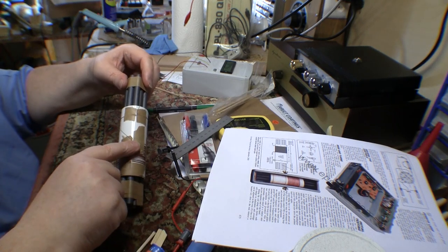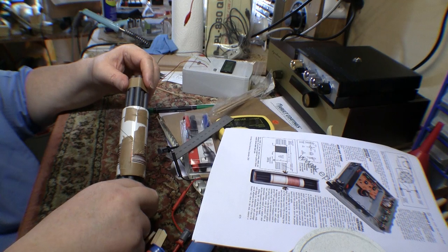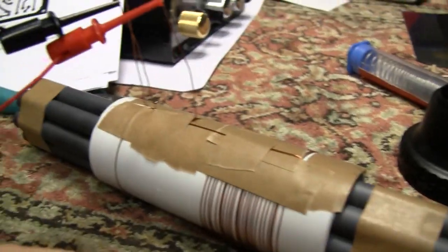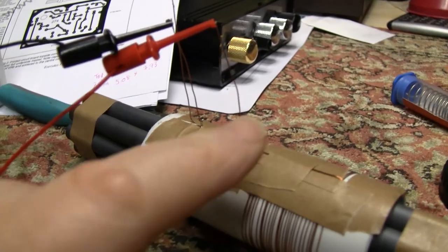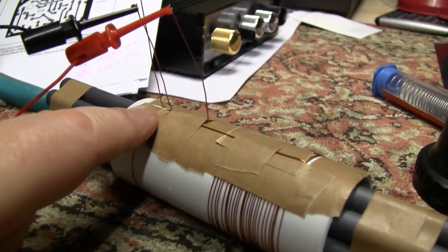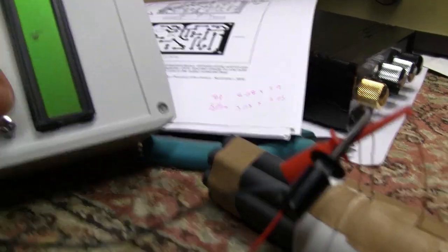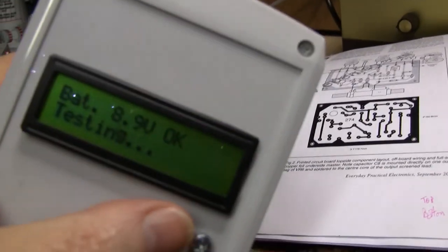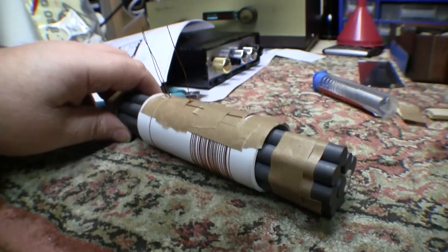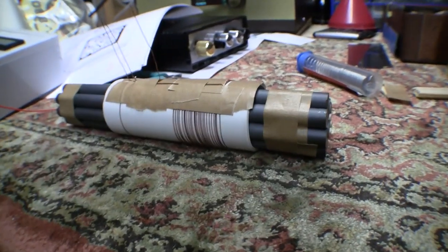The next thing to do is just make all the wiring safe — plenty of little bits of glue here so that these things are not going to come undone. Then see about building the box to put it in. Here is the ferrite coil assembly all dressed up. The start of the secondary goes to the start of the primary, and then you have the two ends of each coil which go off to the circuit board and the common in the centre. The inductance is 170 microhenries — close enough to 160 for the purposes of what I'm doing here. This thing weighs a tonne; it's extremely heavy, so the tilt mechanism is going to have to be pretty robust.